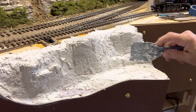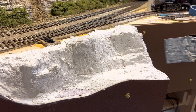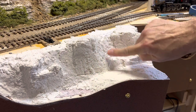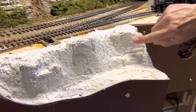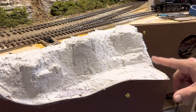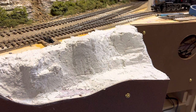What I do like too is that if it's this dry and you get any crumblies down on the floor, just let it dry a little bit more and pry it off. You can come back in and work it however you want. You can use your fingers, you can use other tools and carve it at this stage. I just happen to like to put the skim coat on. So I'll let this sit a little bit and then come back in with some plaster. That looks good.